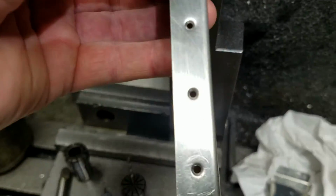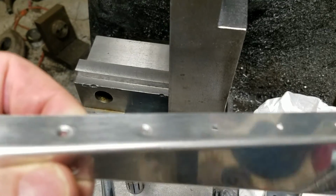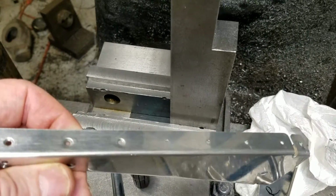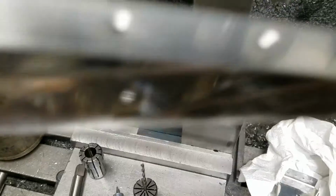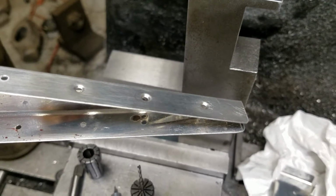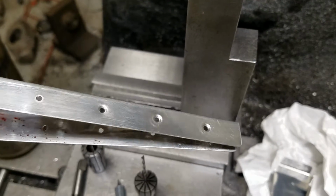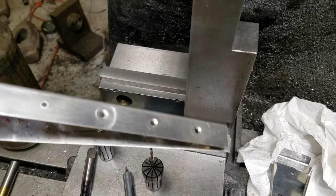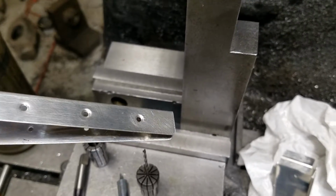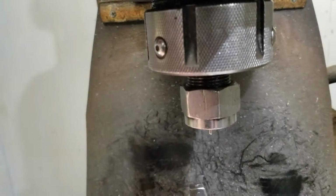One thing I was going to show is if you don't push the die halves all the way together, you don't fully form the dimple. It leaves a little depression around it. These two here, you can see they're flat, and the third one, on the left side, is not fully formed. It's got a little shiner. Like if you hit it with a hammer, it'd have a little depression. Whereas these ones have a little ring where you can see the die hit it. So it's not fully done.